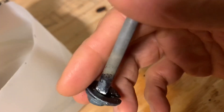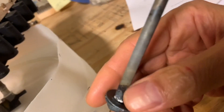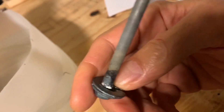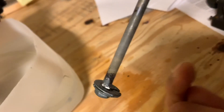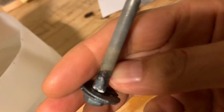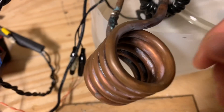For example, there are six turns here, and a work piece such as this piece of metal can be thought of as a single shorted turn. If the work piece contains iron — like this steel — there's another process: the magnetic dipoles within the metal become oriented with the magnetic field as it oscillates, moving backwards and forwards, resulting in additional heating. That's why ferrous metals such as steel and iron can reach really high temperatures.